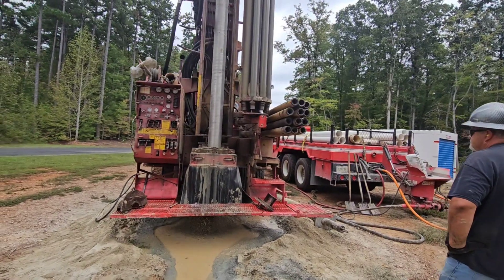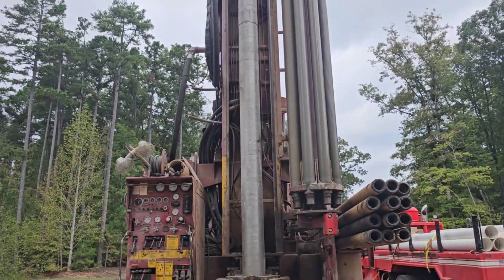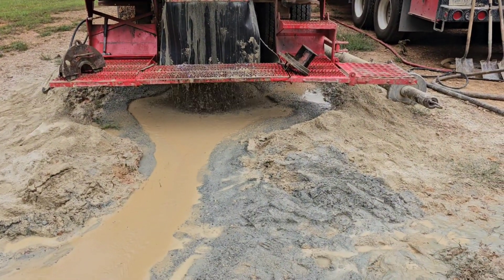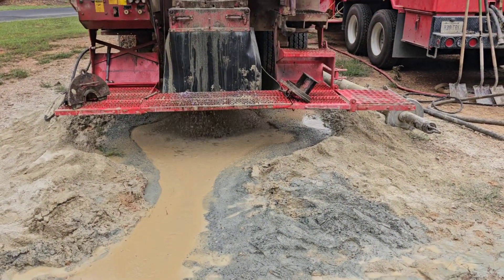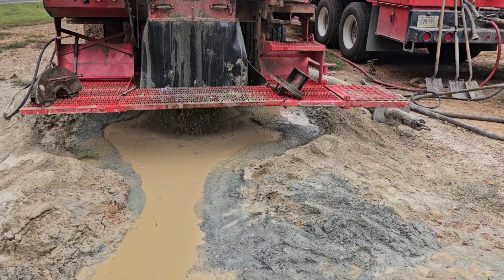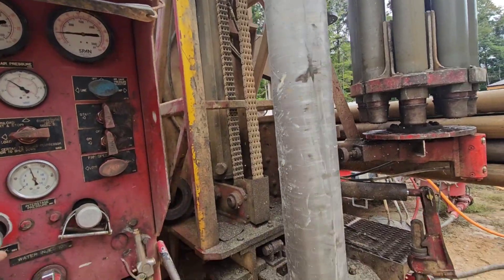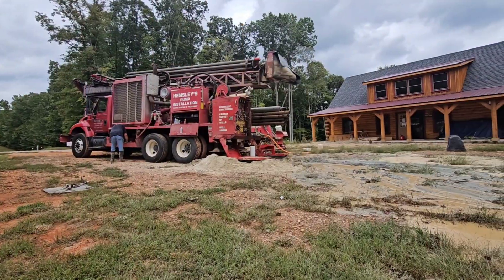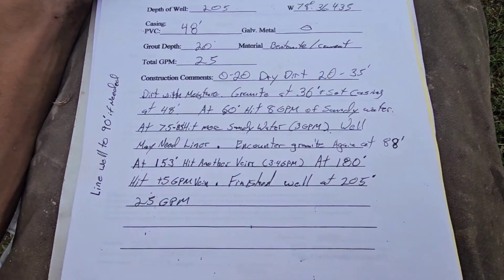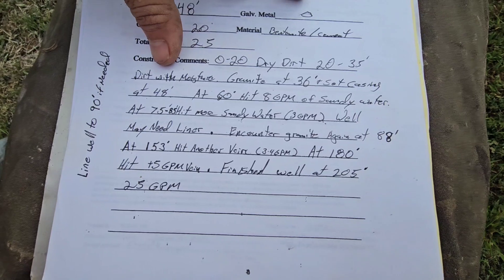So we went ahead and pulled all the rods out, and now we are over-reaming it. That's the over-reamer — it cleans out all of the grit around the outside of the casing, up to 20 feet deep, so we can put our grout around the casing. We've got everything all pulled out, the machine all laid over. I'm just sitting here finishing out my notes, and this is why notes are important.